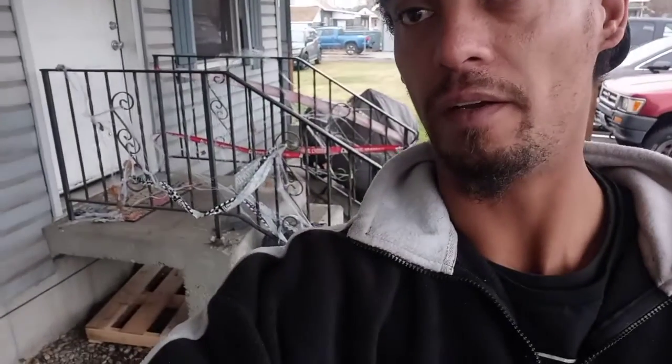As you can see behind me, stuff is blowing around because it's windy. A lot of people don't realize that when you're doing MIG welding or TIG welding, any wind at all is going to create problems because it'll blow away your shielding gas. That leaves you with basically two welding processes: SMAW, which is shielded metal arc welding or stick welding, or FCAW, which is flux core arc welding — also called inner shield or gasless flux core.